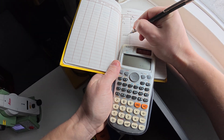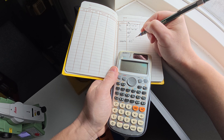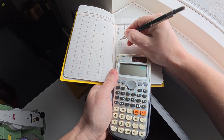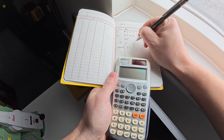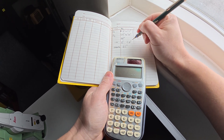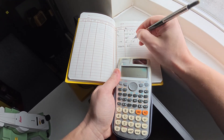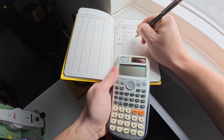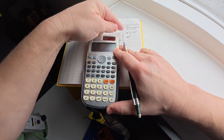Since it's two values taken, that's two times the error — so my actual instrument error in this case is 0.5 seconds. This is great. Typically on site that's the finish of our check, and we compare: it should be less than 10 seconds. But check your ITP document to make sure — the error typically should be less than five seconds.